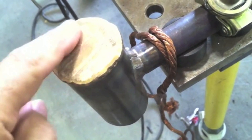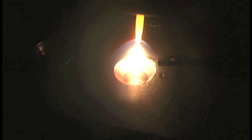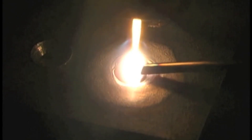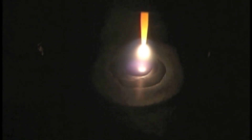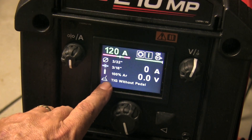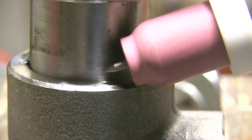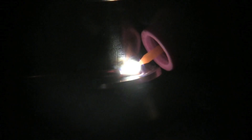High frequency kind of steps you up into a whole other game — it lets you do a lot more small parts work. One example is a little hole fill, which is a very common operation for doing work for machine shops. Being able to start without touching helps your electrodes last longer. You don't risk contaminating anything or leaving a piece of electrode for a tool bit to hang on if it's being remachined afterwards. Being able to taper off and not leave any defect is a big benefit. Now, this next machine is a lift arc TIG, stick, and MIG welder — it's a Lincoln 210 MP, quite a bit more than any of the other machines shown today. It's strictly a DC TIG welder that also does MIG and stick.